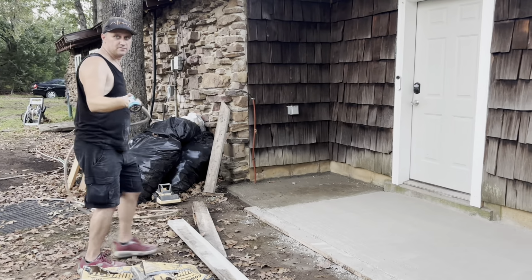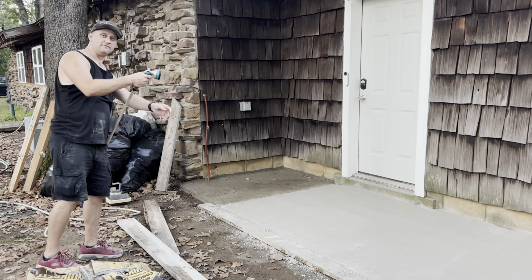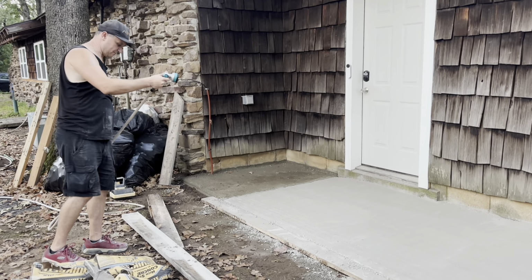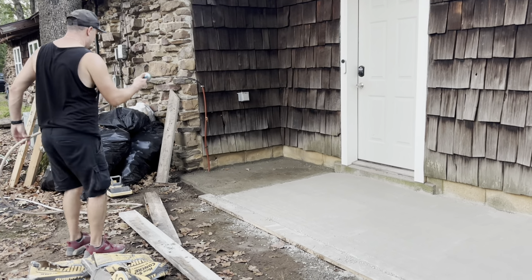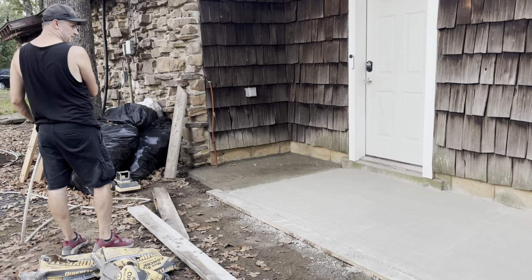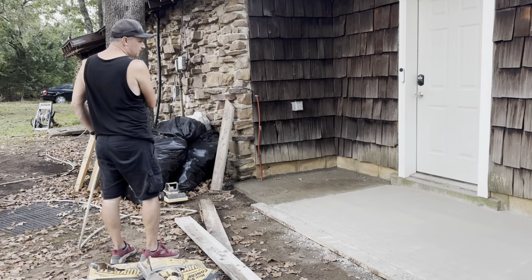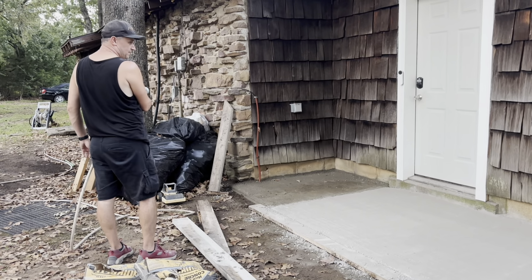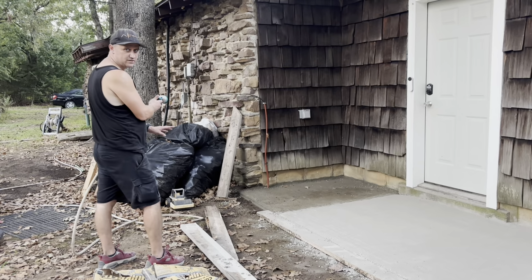All right, guys, so kind of what we said yesterday, you don't want to stand above it because you can see how it's dripping. If it drips in it, it'll leave those little drip imperfections. So we're just gonna go lightly here. I usually start it over here to make sure it's not spraying crazy or something weird like the handle broke, like happened yesterday. That happened before we started spraying. Then we'll just go lightly and mist it once the first coat, just enough to get it wet.